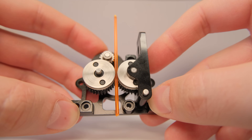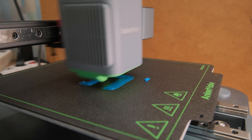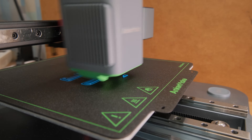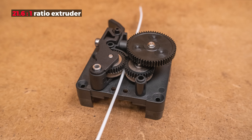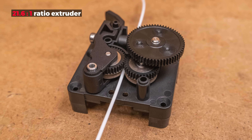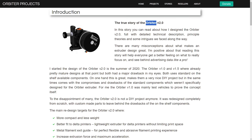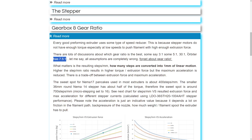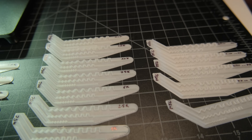By using a higher ratio we can achieve greater torque. But as with everything in life, there's always downsides — mainly the higher you reduce the ratio, the faster the stepper motor must be capable of accelerating and rotating. And when you reduce the ratio to an insane 20 times, it raises a question: is it actually stupid, or just doesn't matter? Especially as one of the most praised extruders, the Orbiter 2, uses a way lower gear ratio, and almost nobody in the 3D printing market uses those higher ratios. So I went on a testing quest to dig deeper, because surely it has to be something — it can't be nothing.